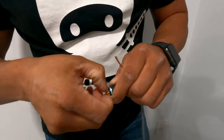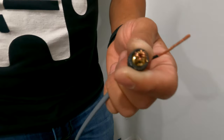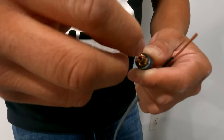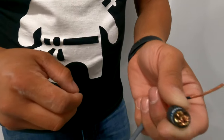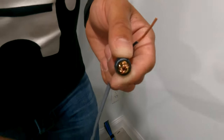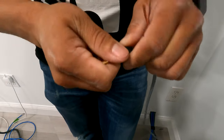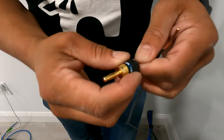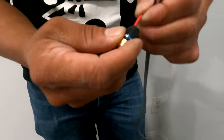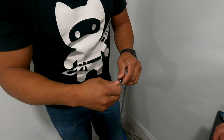So that's what it looks like. Honestly because it's thicker wire, maybe it's a better example for you guys to see what's going on — the thinner wire looks beautiful when you do it, like a nice flat ribbon of strands flowing over in an umbrella fashion. That's what I mean by umbrella — all the wires are just pouring over the top. Then you take your cap, screw it on, and it compresses and squeezes the wires onto the other portion. The last step is making sure your cap is tight and tugging on the wire to ensure a nice solid contact. That's a finished termination — I put the wrong barrel on it but it's okay.